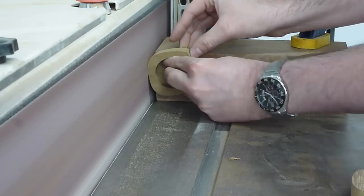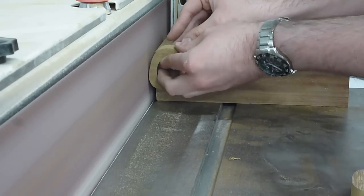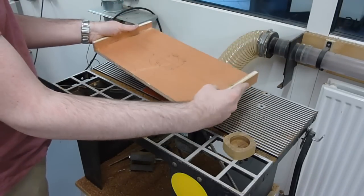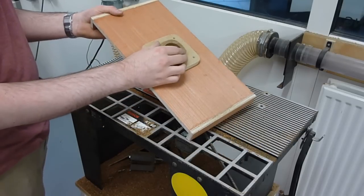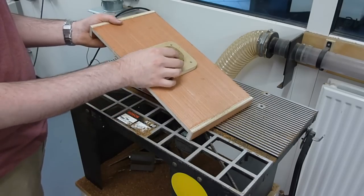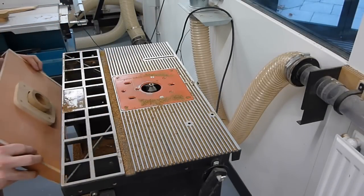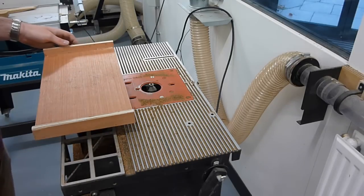Then working on the corners just to round them over — it's personal preference whether you round them a little or a lot. To put the chamfer on the tea lights we're using the router. I've made a simple jig, which I'd suggest using as otherwise the hands are a little too close to the router bit, and the tea lights should sit nicely within the jig as it's used. Be careful as ever with a router to make sure you're going the right direction against the cutter.